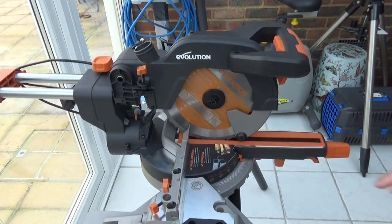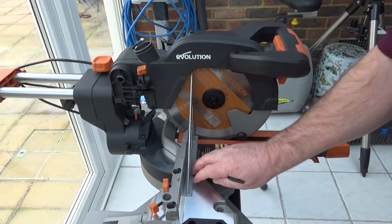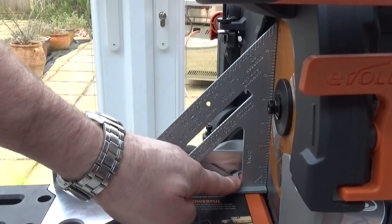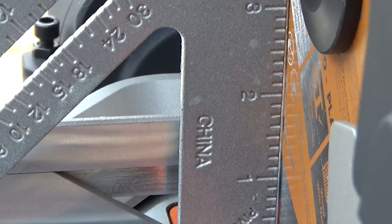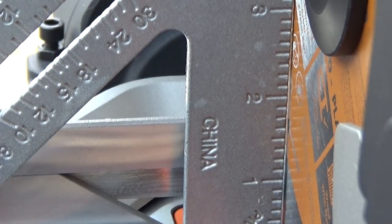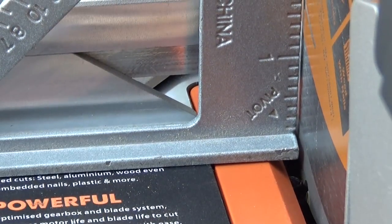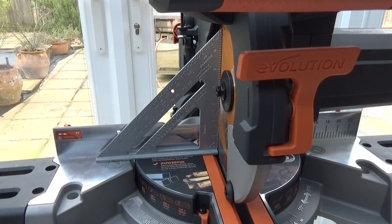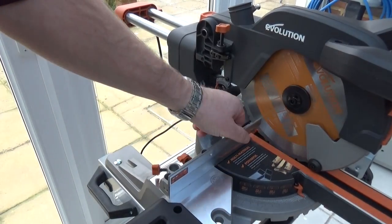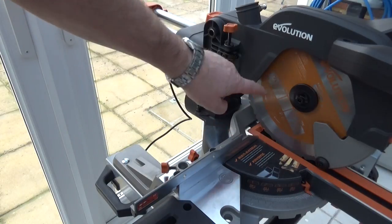The second check is to make sure the blade is at 90 degrees to the table. The set square needs to be flat on the table and pushed against the blade, touching it along the full length. As it's come out of the box there is a slight gap at the bottom of the blade — it's touching at the top but it's not quite 90 degrees. The top of the blade needs to go to the right to make it square. Before making adjustments on the cutting head, pull the sliding fence back at the top to stop it interfering with the blade.